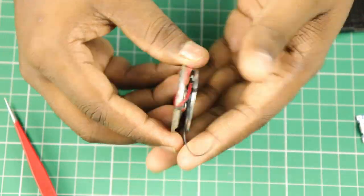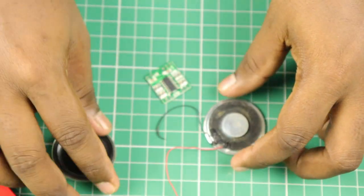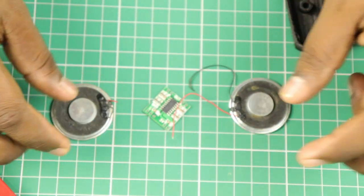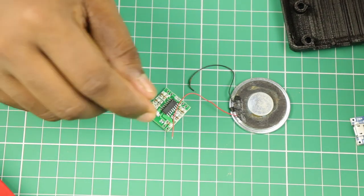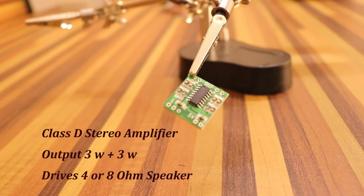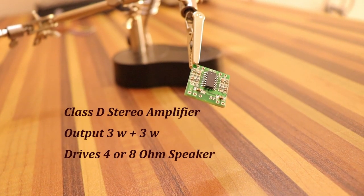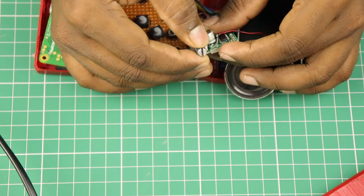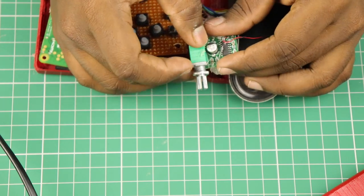Games are exciting only with sound, so I am going to use a half watt speaker. Since the mono sound from the Pi is more than enough, but the audio signal produced by the Raspberry Pi is feeble, we need an audio amplifier. I am going to use a PAM8403 stereo amplifier module, and we can use a single channel from the stereo amplifier. There are two versions of this amplifier module — one doesn't have any onboard volume controller circuit and we have to control it in software, but the other has a potentiometer for directly controlling the volume using the knob. I am going to use the version with the knob.